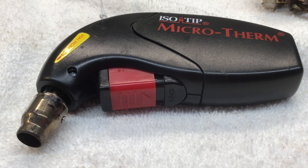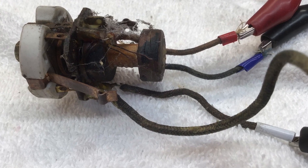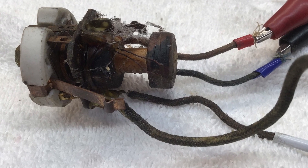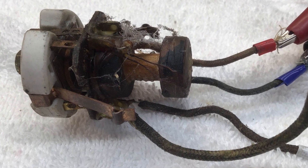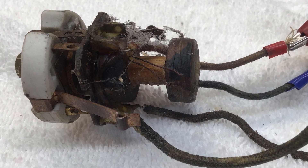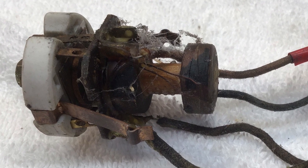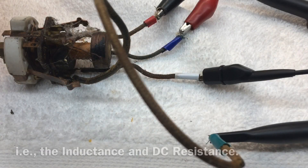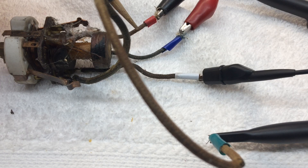The coil itself has a little less wax — I used my micro-therm device and went back over the coil, and a little bit of wax dripped off. Let's take a look at the first IF transformer. I pulled it out because I want to take care of new lead dressing on it, and I found something very interesting. Even though the health of the first IF transformer tested good in-circuit, I wanted to take it out and redress the leads.